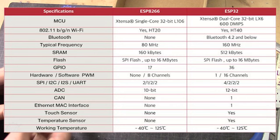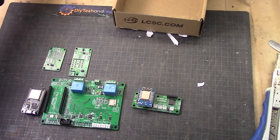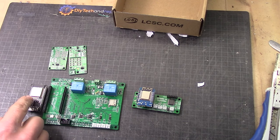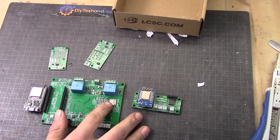The ESP32 has so much more inputs and outputs — for instance, it already has built-in support for the CAN bus and the RS485 parts, and it can control a lot more than the ESP8266 can do. As you can see here, we have RS485, we have the ISP programming header to program the cell modules themselves, we have some IO pins, the CAN bus, and we have RX-TX both for the cell modules and for other parts.